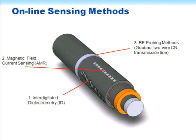So this is a typical piece of jacketed distribution power cable with a center conductor with some insulation, shown sort of in yellow here. Then there's a semicon, which is a conducting plastic coating, and then on top of that are wires, copper wires typically, that wind their way down the cable, known as concentric neutrals. And then on the outside is a jacket, a protective jacket.